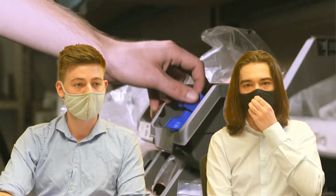So we use better materials in the Prusa. We use higher temp PETGs instead of PLA. We've designed parts a certain way to work better with the Prusa use case. And then of course, all the software functionality and firmware functionality that the Prusa provides has to be supported in Quinly as well. Whereas the Ender doesn't have any sort of hardware failure catching. So there's a whole bunch of extra features that come with Prusa being a higher end machine that we then have to support with a higher end kit, if that makes sense.